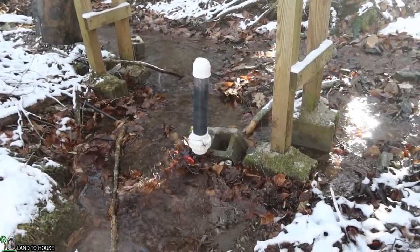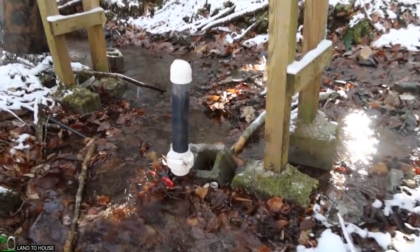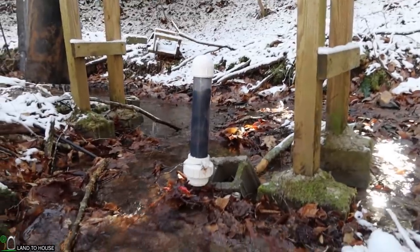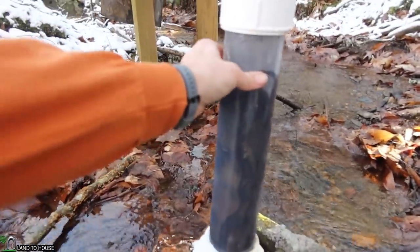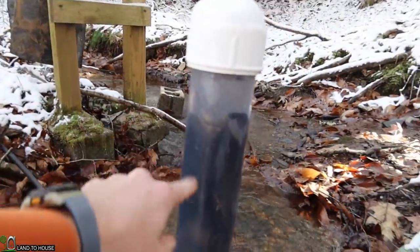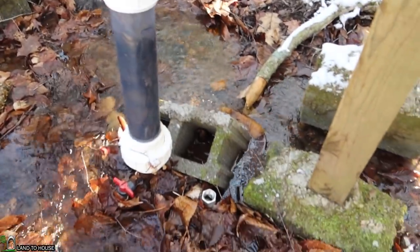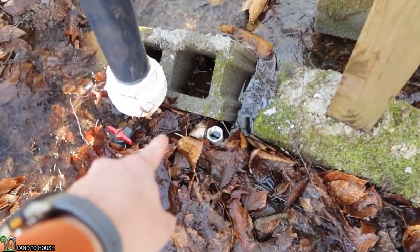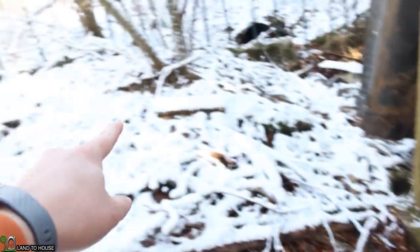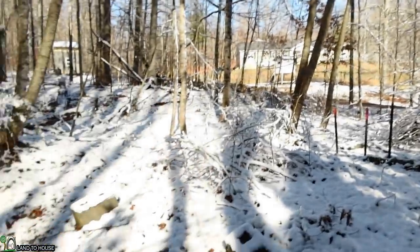Let me show you my pump over here — we'll have to go up to the initial intake, clean things up a bit, and get water flowing to the pump. Buried up under all those leaves is my ram pump that I use for most of my testing here on the property. It's not frozen, but it does have some ice in there, so hopefully that will melt out when warmer water hits it. There's the waste valve right there. The inline valve is tucked up under the leaves and the delivery pipe skirts up the hill — you can't see it through the snow.